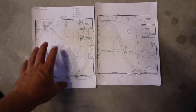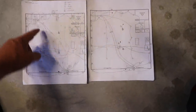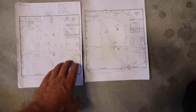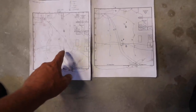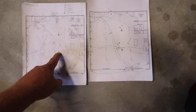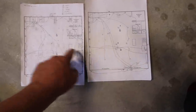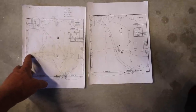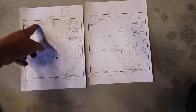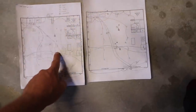On the left here is my old ceiling lighting plan. Well, it's electrical in general, but anyway, this lighting circuit here is a three-way circuit. This bank of lights will be on one switch and this bank of lights will be on a different switch. I'm not sure why, but I had it in my mind that I had to bring power up here for the lighting circuit, and then I would feed this bank of lights, and then I would leave a box here and here for future lighting if we wanted to add cabinetry and stuff. But the problem is the stairs over here also need a home run, or some sort of power source to power the stair lighting. So I'm going to end up having to run a home run over here to this box.